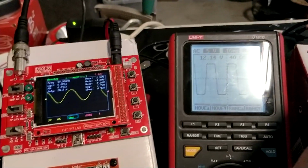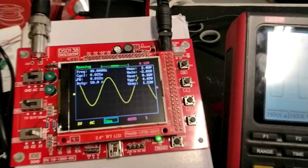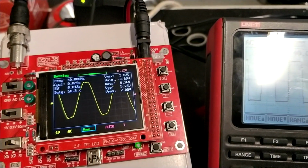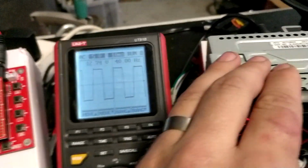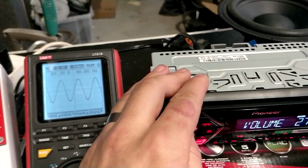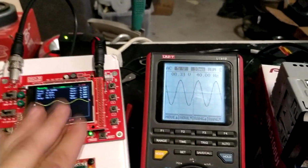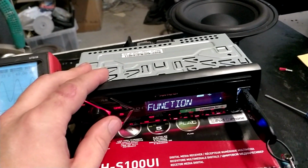I need to drop it down to the 40s. RCA 49, 50, that's around 52, still okay. 52 still okay for the RCA side, and we need to go down to like the 20s with the internal amplifier. 27 still okay. Now as you can see, it affects the RCA also, very good to keep in mind. Then we can check the audio.